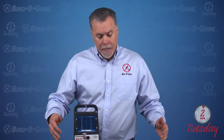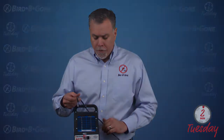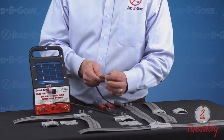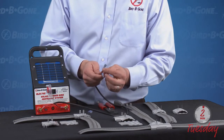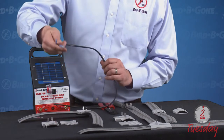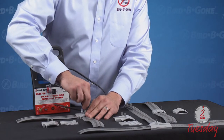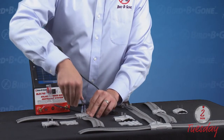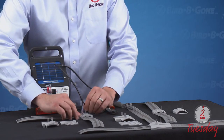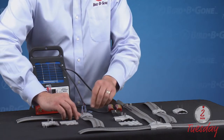Now that all the connections are nice and tight, I need to run the lead-in wire back over to the charger. To do that, I have this 14-gauge copper lead-in wire that has the two wires embedded on it. Splice it down, put our two blue wire connectors on each end here, and it has a nice flat side that we're going to be attaching directly to the male prongs that are on the top of these connectors here. Since it is an electrical system, we need a nice tight connection — this is the weakest portion of the system — so we want to crimp these down and have a nice tight fit.